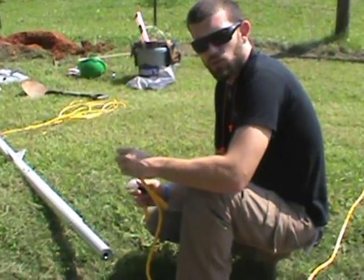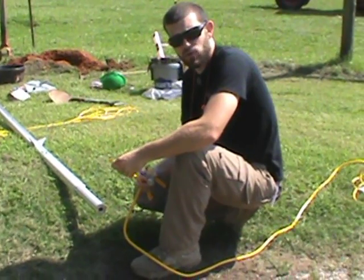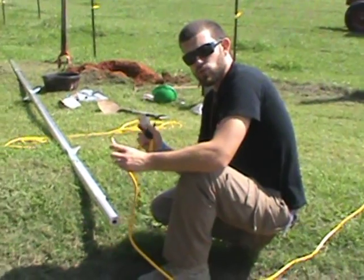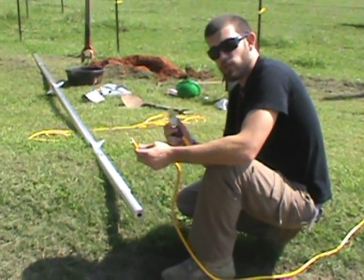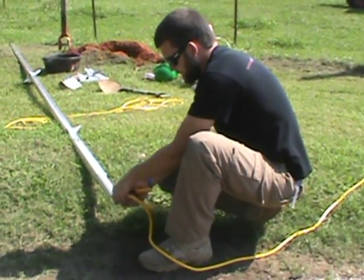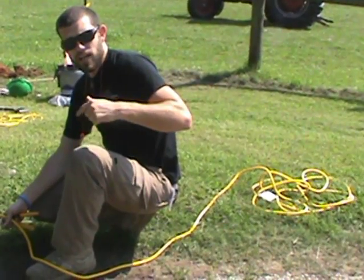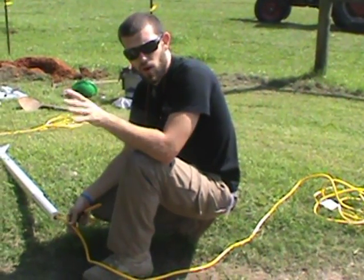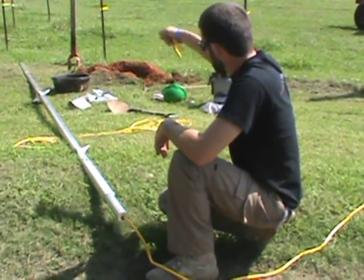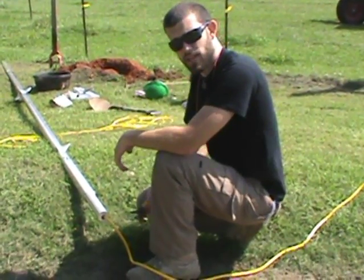Since I want to keep this compliant with our local electric company as far as selling power through green power switch, I'm going to use this UL-listed outdoor commercial cord that is 12-gauge wire. I'm going to cut the end off and use this as the wire to feed power from the PMA on the turbine back down into the house into the wiring board. I'll run this wire through and show you when I bring it out the end how I'm going to start it into the conduit pipe.